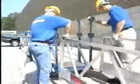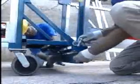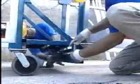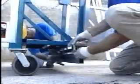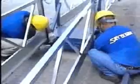If you need to extend your work platform beyond 40 feet, you can connect sections of the unit with a horizontal hinge assembly. First, connect one of the MKD sections to the wheel side of the horizontal hinge assembly. Connect the side panels and rails of the next MKD section.